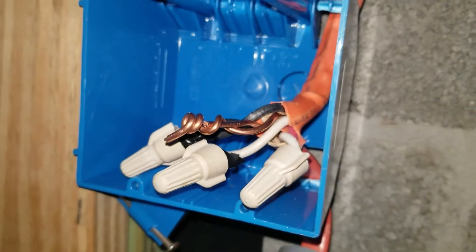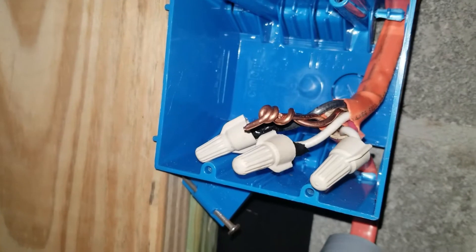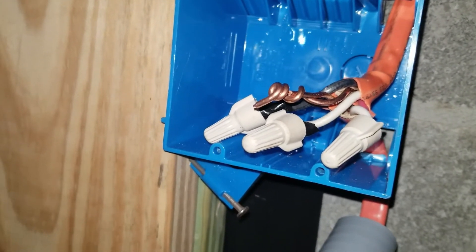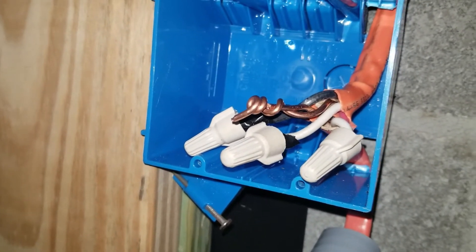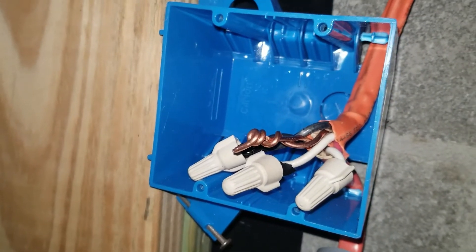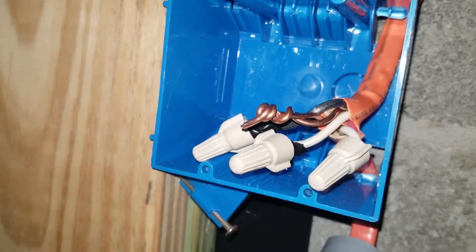So I recently purchased a hot water heater and it was performing very poorly. Couldn't really figure out why. I was reluctant to call someone, but I broke out a voltmeter just to make sure I didn't have to do this work again, and it only showed 120 volts. When you're only getting 120 volts, that's a problem.